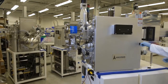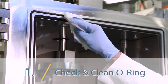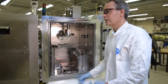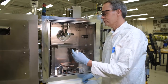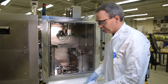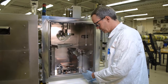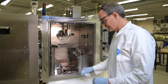If we believe the loss of base pressure is caused by an actual leak, one of the first things I suggest checking are the door seals. Door seals can be wiped clean with a clean room cloth and isopropyl alcohol. You can visually inspect them to make sure there aren't any signs of damage. Most o-rings on doors, especially glove box doors, have a little bit of grease on them — that's there primarily so the door doesn't stick. Most of the o-rings we use are actually joined together in sections, so in some cases they may have one or two joints you can inspect to make sure they're not split. On some occasions the o-ring will separate and cause a leak. It's actually quite rare that we have to replace the o-rings — they tend to just need to be wiped clean. You may find Kapton tape, a little bit of foil, some hair, or some particulate across the o-ring causing a conductance path and a leak.